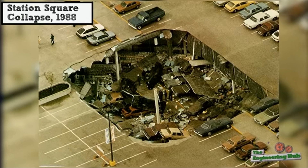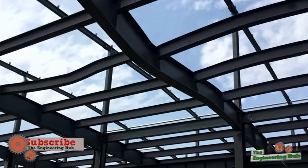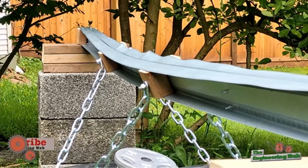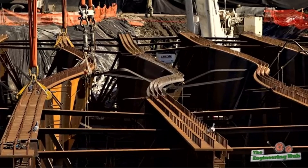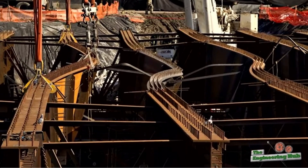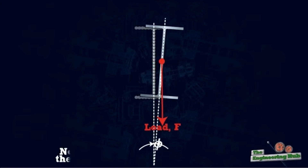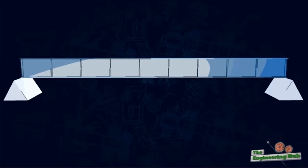You can see how horizontal forces on beams can start to cause failure, and that's exactly what happens in a lot of racking systems and structural engineering systems. The beams get horizontal forces they were never designed to support. This looks a lot like what could happen to a column if horizontal forces — like uneven loading, certain types of bends or twists, or the lack of lateral supports like struts — cause the beam to go off its center line and have torsion.